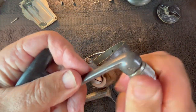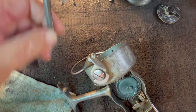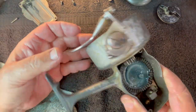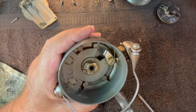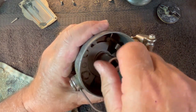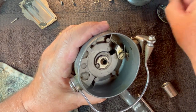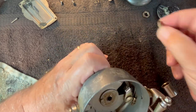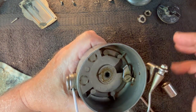This handle is a collapsible handle where you just screw it and it allows it to drop down. We'll clean that up a little bit and put some oil in there. You can't take the main gear out without removing the nut from here — that looks like about a 14 millimeter. That's not even tight. The nut comes off — I'll set that over to the side. There should be a locking plate here — there is. It's kind of greasy, but aside from that it's okay. We'll need to get some of that corrosion off to make it a little prettier.